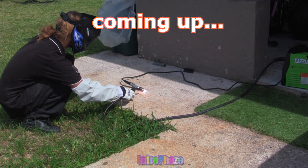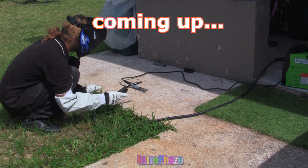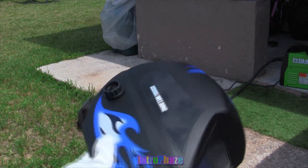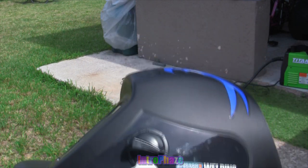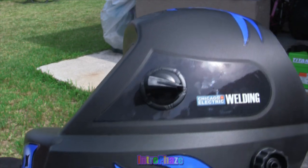What's up, guys? Today, I'm going to show you how to set up your welding machine and get started welding in no time. In this video, of course, you're going to need a welding machine. I'm using the Titanium 125 flux, welding mask slash helmet, and I'm using an auto darkening helmet, and I usually like to put it at 10 to 11.